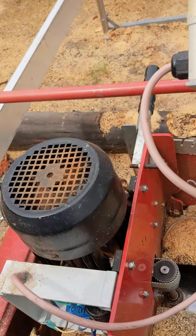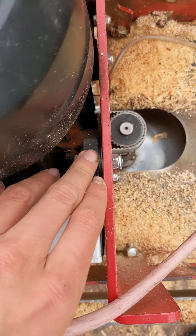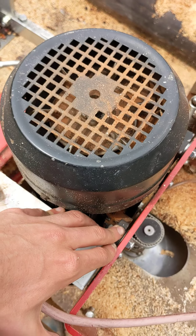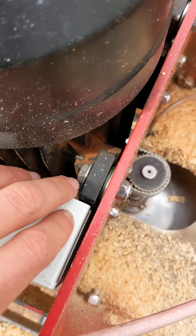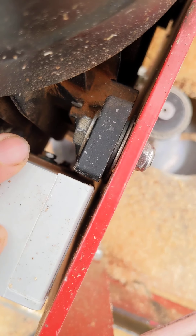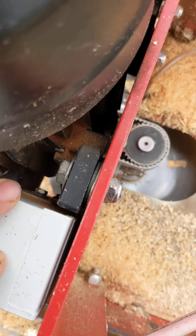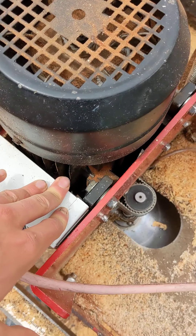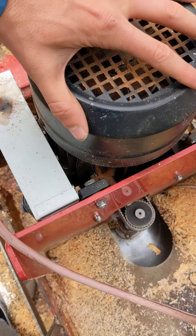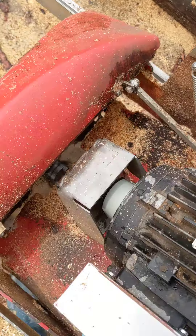Other changes that have been made: I had to reduce the belt tension. The way this motor was set up before, it had three washers on each side. Now it's got two. Three is too much tension. At rest, when you have the belt on, the motor will sit up at an angle, so that when you tighten the nuts down, it pulls the motor into place and increases the belt tension.